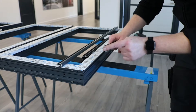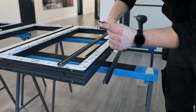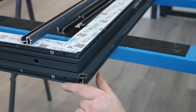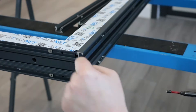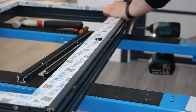We need to add the lock add-ons for the lock strip and the sash extensions on the bottom of each sash. First, we add the lock add-ons with the small leg towards the thermal break, making sure it is flush to the ends of the sash. Once you've put the first screws in, make sure these add-ons are still flush to the ends of the sash. If not, they can be tapped back into place with the mallet before putting the remaining screws in.